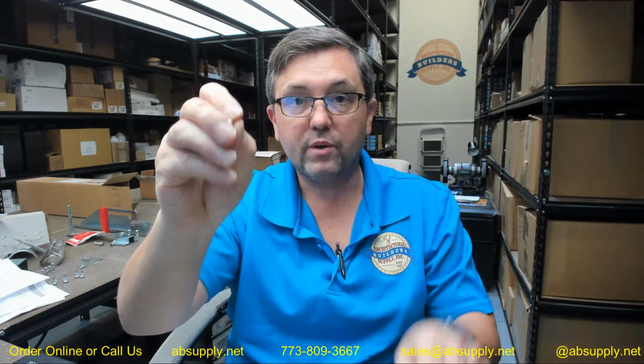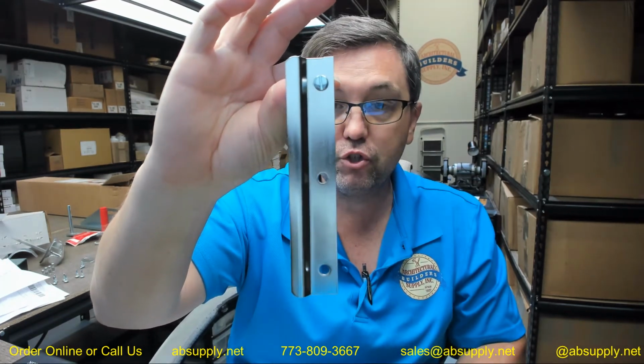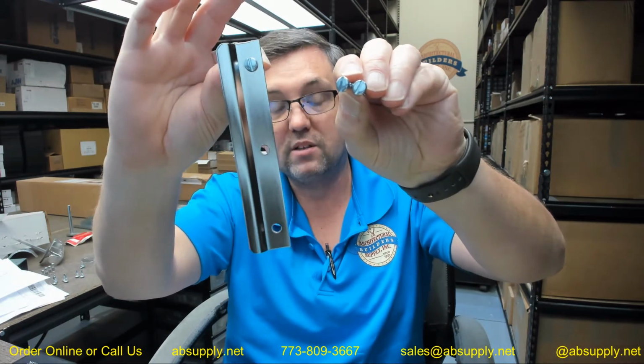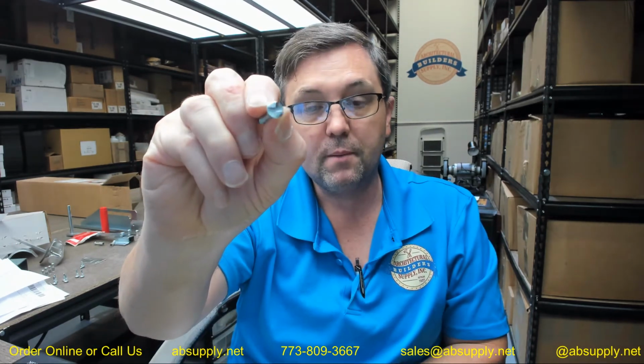These are the temporary screws. You want to install that and have a way out should you need to reposition. You'll use the 3 slotted screws. Once you're really satisfied with the location of the frame portion, then put your one-way screws in. Okay. You could leave the slotted screws there, I suppose, but the one-ways are what are intended to be there, and that's exactly what those are for.